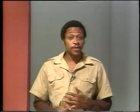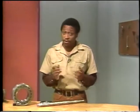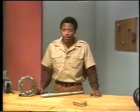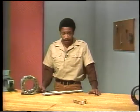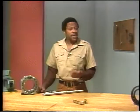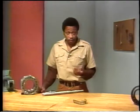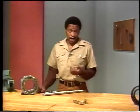Let's go on to the next type, lubrication failure. As you know, the lubricant in a bearing is supposed to reduce friction and prevent metal-to-metal contact. For the most part, high operating temperatures indicate lubrication failure, although any type of failure can cause the bearing to overheat. The signs that a bearing's running hot are burn marks, discolored lubricant, and a burnt oil smell.